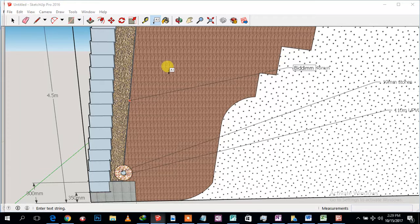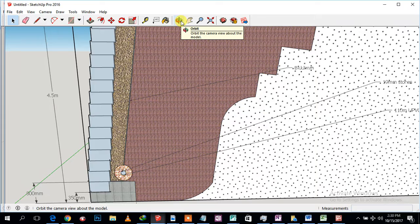We can put the bidim cloth between the gravel layer and the excavated material so that it can hold, because the pressure normally comes from this excavated material, which expands and contracts. It should be held up by this cloth. It's a geotextile fabric, what we call geosynthetics, used in stabilizing the soil, right? It holds everything. It grabs the soil in place. We're going to lay that as well.